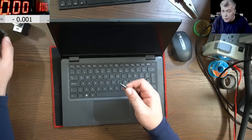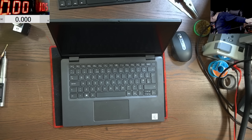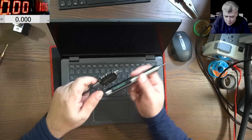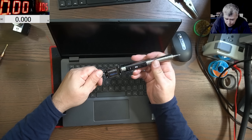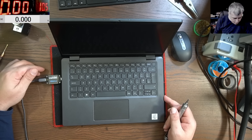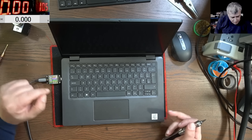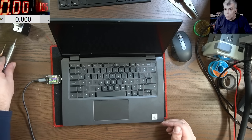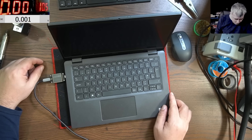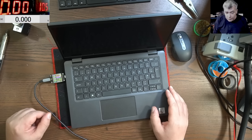Let's plug the charger and check with the USB-C power meter to see what's happening. The power meter is working. Now plugging in the USB it's saying 5 volts and 200 milliamps — that's not good, that means it's not negotiating the voltage. Trying the other port: 5 volts, 200 milliamps. So the charger is not speaking with the laptop for some reason.